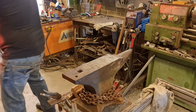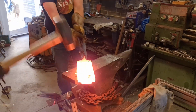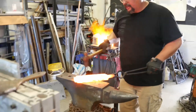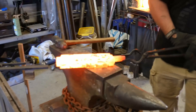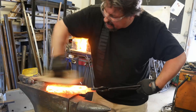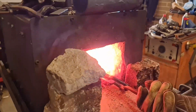Now comes the hard work — taking out the mold and hammering it. For the record, that's me doing all the hard work. I don't want to let it cool down too much right now because we're still in the forge welding process. If you start hitting it when it gets cold, you're going to make cracks in it. Thanks for the tip, Dave.